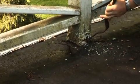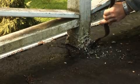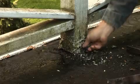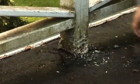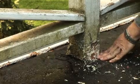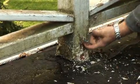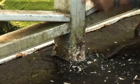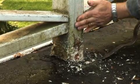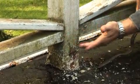And there you can see the copper. Let me remove that. Now you can see the copper flashing there. And this roof is attached to the copper there, and the copper comes up to somewhere there. You can see that's where they stop the copper. And the problem with this situation is that the water comes down here and goes right behind the flashing there. And then you have a leak.